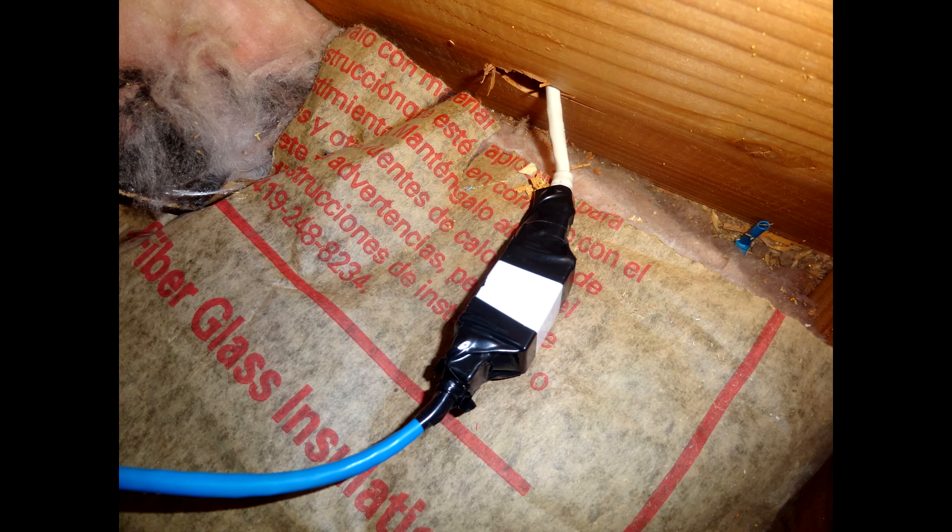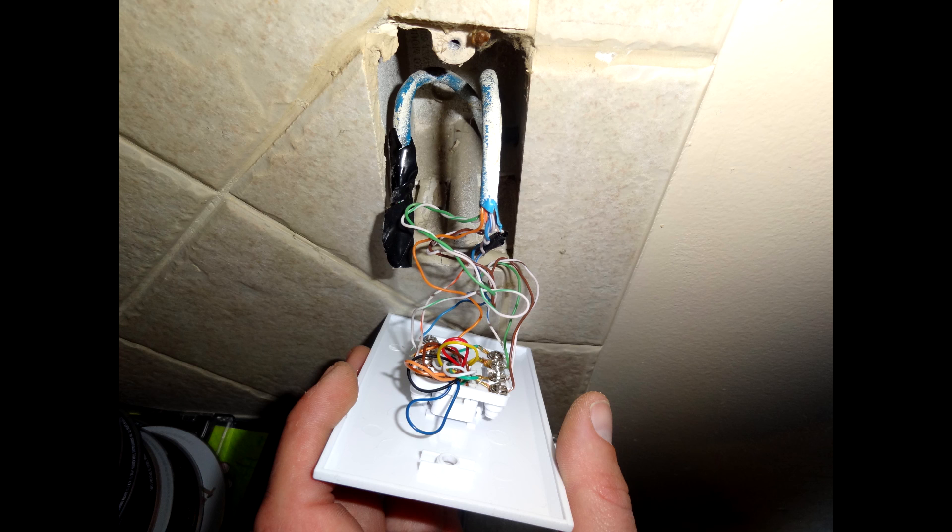I'm not a professional installer, so what I did is I added electric tape to the inline Ethernet connector. Whenever you crimp the cable it is waterproof, but for my own peace of mind I don't want to crawl back up into the attic if there is a continuity issue due to corrosion or water damage from condensation. So I opted to add electric tape to ensure that the signal stays as strong as possible given the corrosive nature of being in an attic. Here's the back of a finished Ethernet jack — one cord ran to it, the other tied off with electric tape. And this is what it looks like when it's finished.